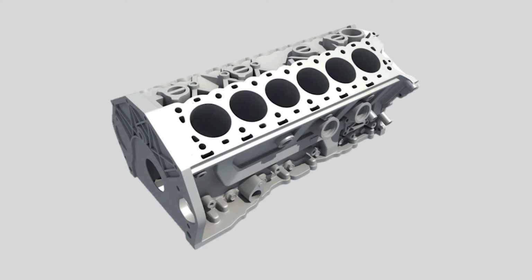So where I'm going with this, you have to have what is called a balance field with multi-directional. Balance field is very critical for the success, because what happens in multi-directional setup is if you have one field, you have longitudinal, you have circumferential fields, the flux flows will actually hit those simultaneously, bam, bam, one right after the other. But if you have them where they're out of balance, what happens is that last shot, whichever shot it may be, will actually take away what the first shot did if they're not completely balanced. So you don't have one overpowering the other field.